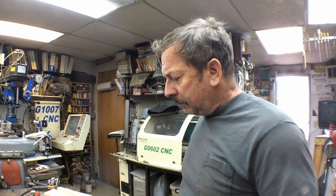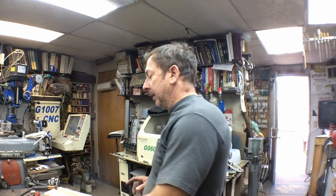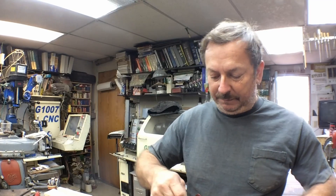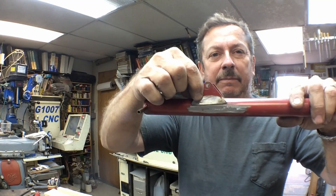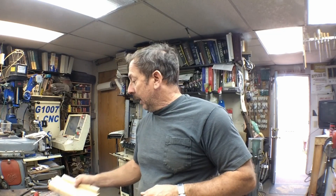As I continue to powder coat control parts, I'm making a little adjustment. All of my forward fuselage controls are done — I'm just going back and re-powder coating what I can. The control yoke: I wasn't real happy with the position of it, so the pivot points that weld on right here — I've actually changed those about a quarter of an inch. I've moved them down, moving the bottom of the stick up, rather than building a whole new stick, and that's going to work out fine.